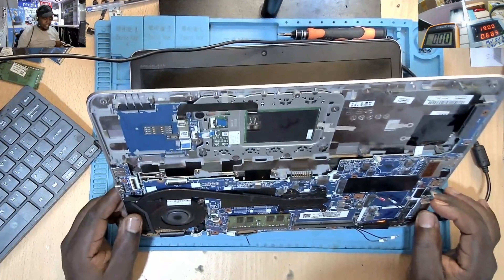I'm going to try another RAM. So what could be the possible causes of a laptop that is coming on — the fan is spinning but you don't have a display? Let's try to assess those. You plug in the charger and you switch on the power button, the laptop is coming on, but you don't have a display. One thing I would suspect is the RAM.